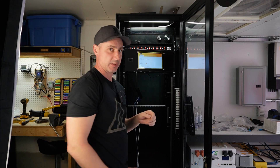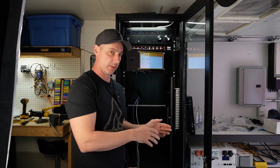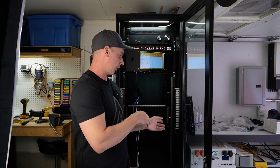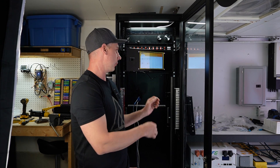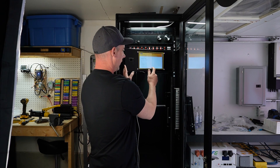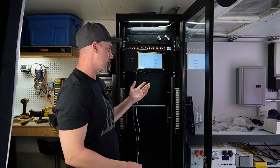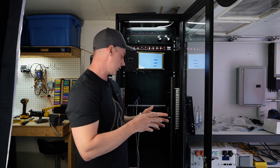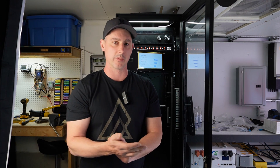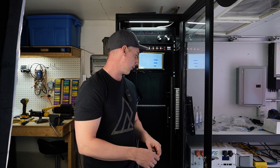Going to battery selection, disconnect from this battery, go to USB serial RS232, save — and there we go, now we're connected. This battery is at 60 percent. Because I have multiple brands, I can connect to each battery one at a time and see all the different parameters: temperature, state of charge, and a bunch of other data. I'm also going to be installing a Victron smart shunt to get an overall capacity of the whole bank. I'll work on wire management next — look out for the next video where I'll be hooking up all the battery connectors. I'm just waiting for lugs in the mail, so look forward to that. Thank you for watching!